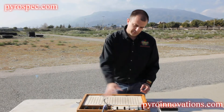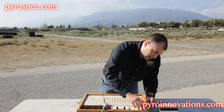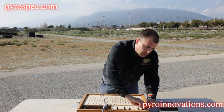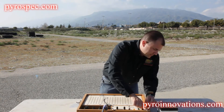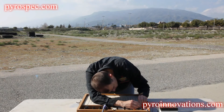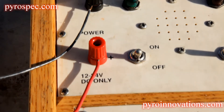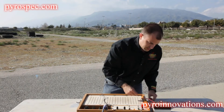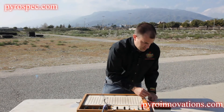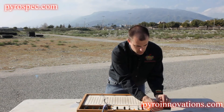Next step — once you have all of that hooked up, you're going to wire up your batteries. You start by wiring to the board first. Wire your negative wire in first, then do the positive wire, making sure you have metal on metal contact. Hook the positive end to the red side of the batteries and the negative end to the black side. Then you have a little jumper wire — these are two 12-volt batteries and we jump them to create a 24-volt circuit.